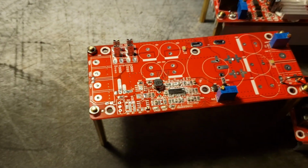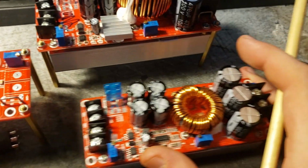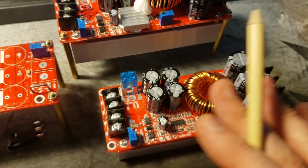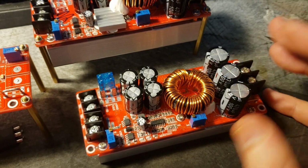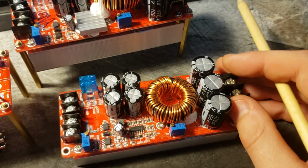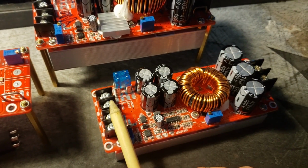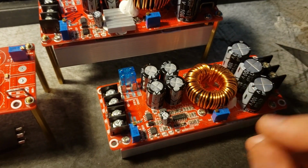So that's basically the modification. It allows this whole module to operate below 11 volts without a whole lot of repercussions. One of the big problems is, if you want 65 volts out and 5 amps out, a certain amount of wattage, you're going to have to derate that if you anticipate going below 11 volts, or whatever your intended design goal is going to be.